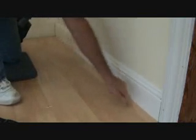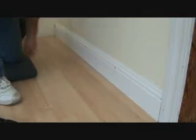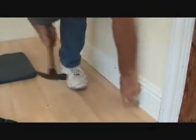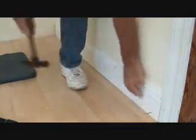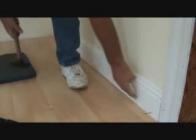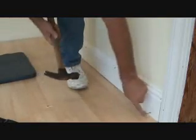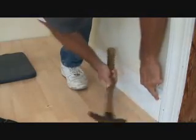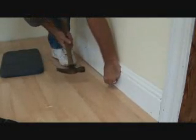Now at the bottom, there's that 2x4 running all the way along here, so you don't have to put these exactly straight underneath these nails. But I'm just going to put them in here. And I'm going to try to keep them no higher than 3/4 of an inch. Because when I put my trim at the bottom, if I got these nails down low enough, that little trim at the bottom is going to cover that. So I shouldn't even have to set these nails at all with the nail set. I can just make it flush. Got my hammer head on the wood just ever so slightly, so you want to kind of be careful with that.